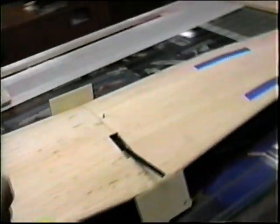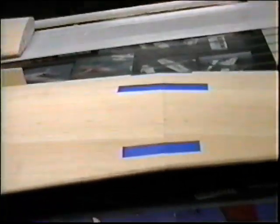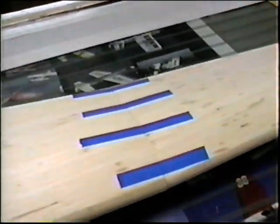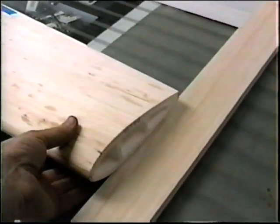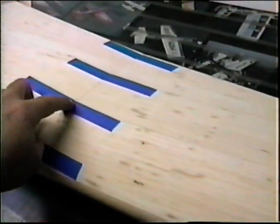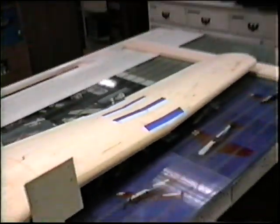Now the same as when we did this dihedral angle, this one was already cut in at a real close angle, so there wasn't much dressing off to do. But what I did is laid it flat, figured out how much I had to go, and I can see I have just maybe a 64th of an inch. I'll dress this edge off just a little bit and we should be in good shape, and I'll be ready